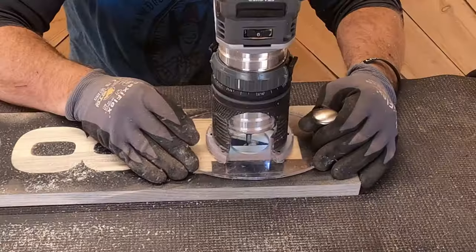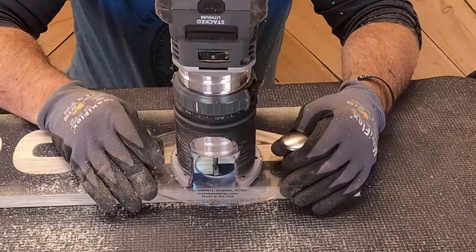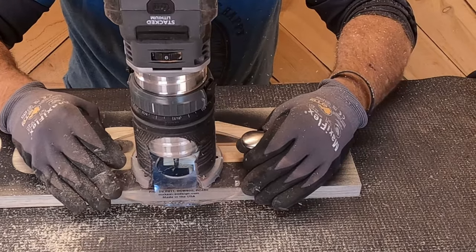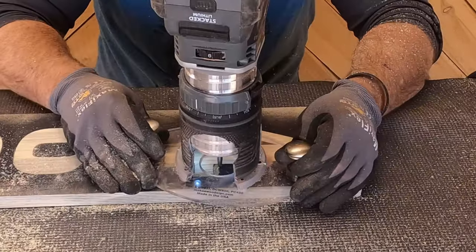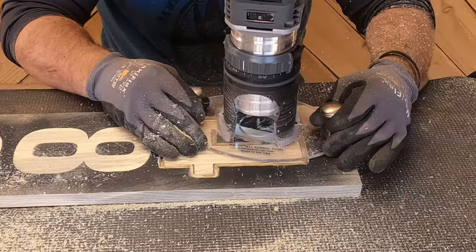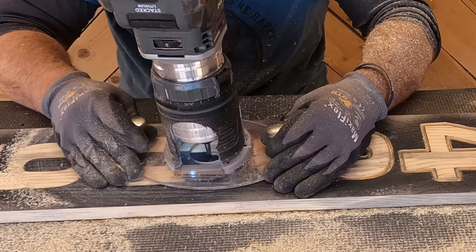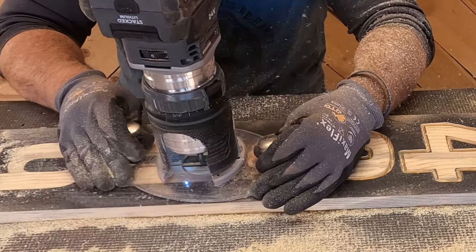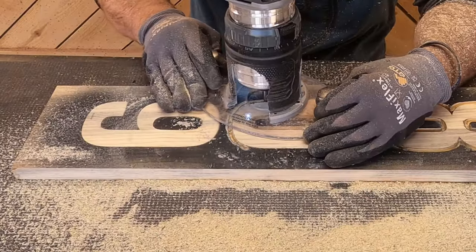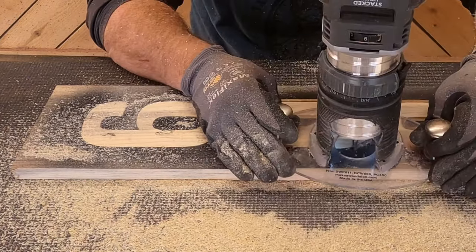The first bit we're using is the profile bit at a quarter of an inch deep. If you haven't been following us for a while, this is the most versatile bit we have, and it's probably the one we use the most. I'll leave a link in the description below for everything you see here today. What he's doing is going around each individual letter giving a nice fat line. We're going to bolden that line up with another bit after this is done, but you want to make sure you just move nice and slow, working your way in towards the number or letter. Don't try to get it all perfect on the first shot — there's quite a bit of room for error when doing this.